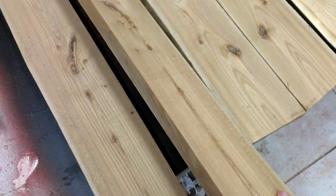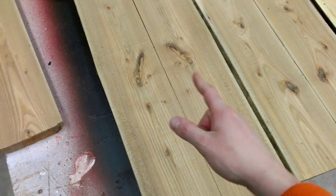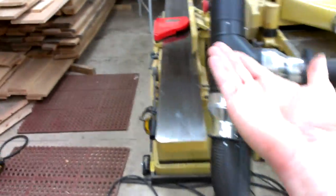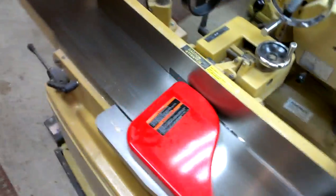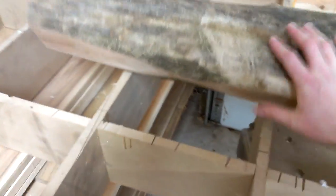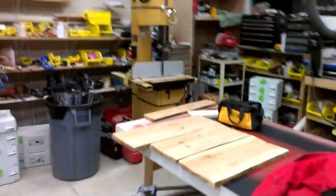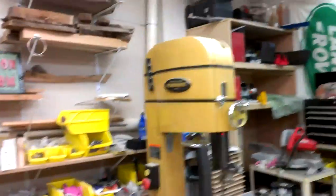I ran them an inch and a quarter thick. I just ran part of it over the jointer and then flipped it 90 degrees and used the fence to put a nice straight edge on it. I'll just run it over the jointer enough to get a flat edge to run on the bandsaw, and then do the same thing — 90 degrees on the jointer — and run them through my Powermatic PM1800.